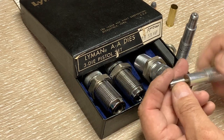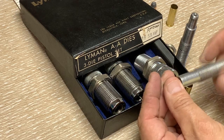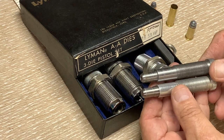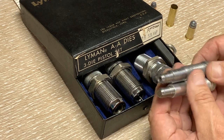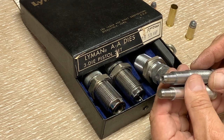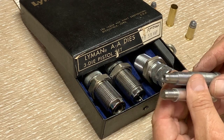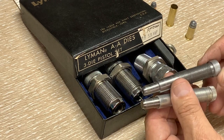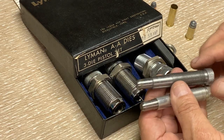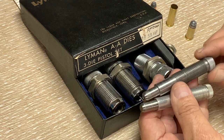So what I ended up having to do was attempt to replace that, and in so doing I made an entire new solid expander pilot. The tip of this is now to .362 so that a .361 bullet will seat correctly in it. That took some doing and there were some problems with the steel. This is made of 4140 and at the end of this presentation you'll see how I made it.